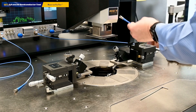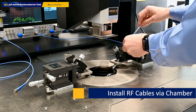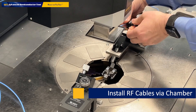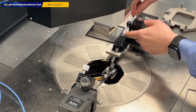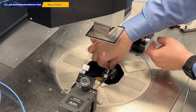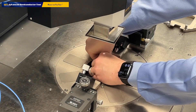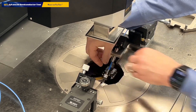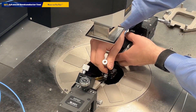Let us connect the cables. We take the cable very gently, without any additional cable arrangement, and simply move it through the mechanical chamber. I would also like to use the cable guides which are available on MPI positioners — they help us to lead the cables in the right direction through the mechanical feed-through of the shield environment system. Make sure that your cable nut is in parallel to the connector of the probe, and carefully rotate the nut until it's fully fixed on the probe body. Tighten it with the torque wrench.